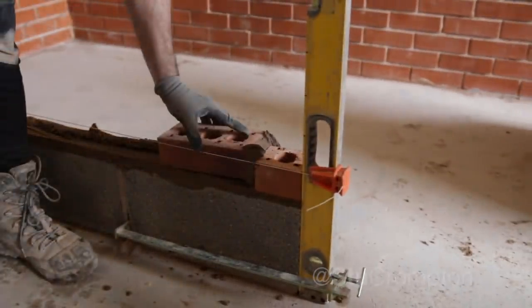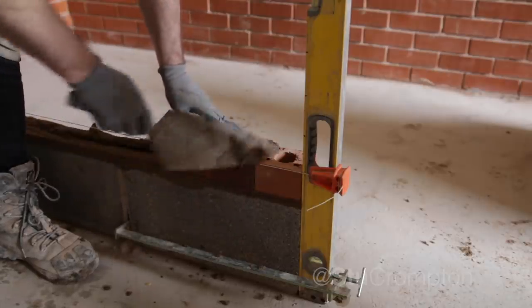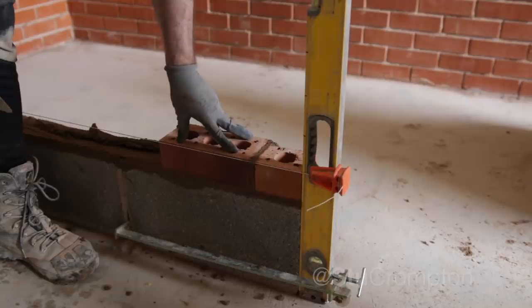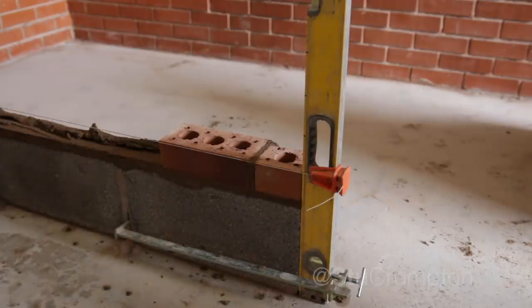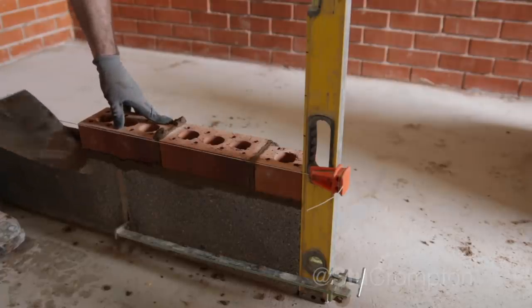Back over to the operating table, pushing onto that brick and scraping off with the tip of the trowel, taking any excess mortar off. If you're not comfortable pushing it down with pressure on your hand, you can tap it into place with the butt of the trowel. Then get your next brick, butter it, give it a wiggle onto that one and push it into place.